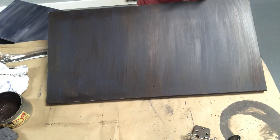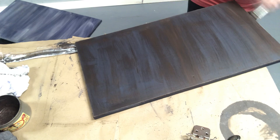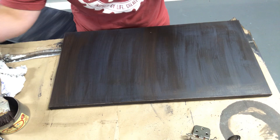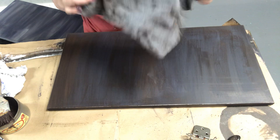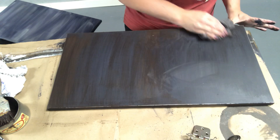You could also use a glaze — I'll do another video about that — or a clear coat, which is kind of like a polyacrylic over the top, but it's not necessary. It just depends on where you have the piece. Our front doors and flower pots outside the store are chalk painted with nothing else on them — no extra protection — and they look awesome. You do not have to add protection if you don't want to. Now I'm taking a cloth and buffing the wax into the paint. I never want the wax to feel tacky; if it does, I need to buff it in more.